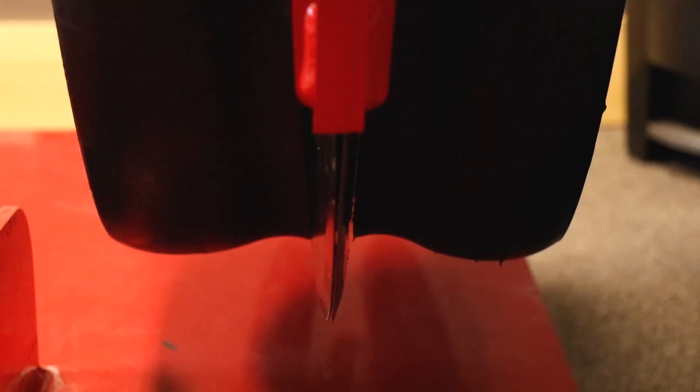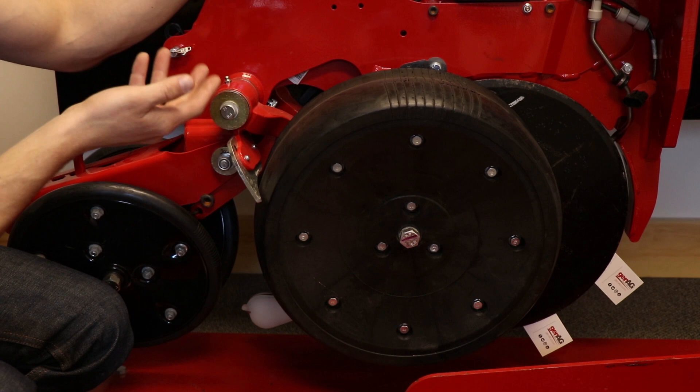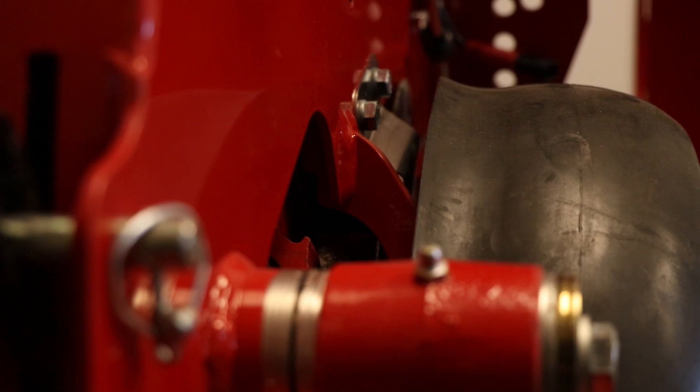You want an inch and a half to two and a half inches between the two business cards. Anything less than that, your discs need to be replaced, and anything more than that you have to adjust the shimming. To adjust the shimming on the opening discs, really simple — pop off your gauge wheel and take a look at your shimming disc. There are shims on either side of the bolt. Move your bolt and you can shim in or shim out. Whenever you take a shim out, you can put it on the back side of the disc and vice versa, just to make sure that you have a tight connection to the shaft.